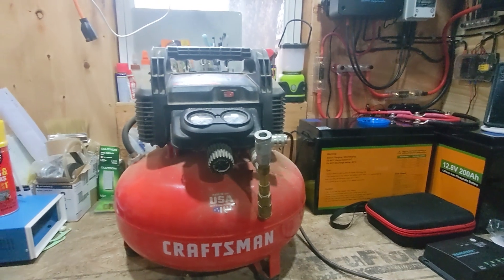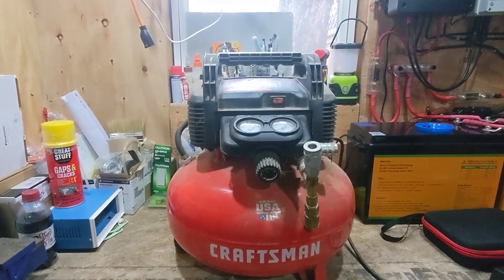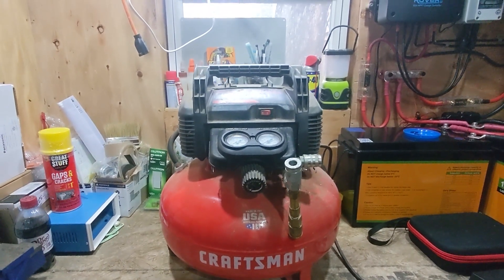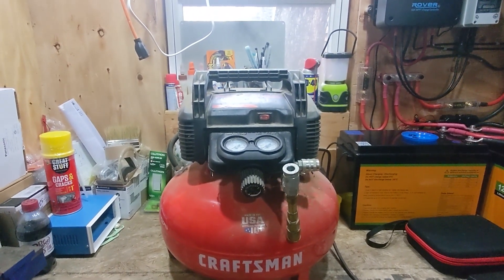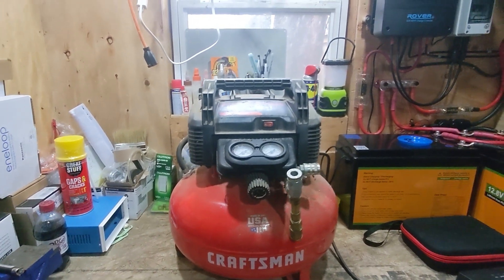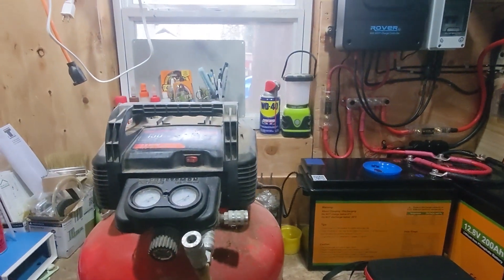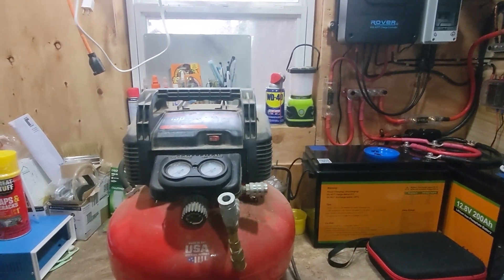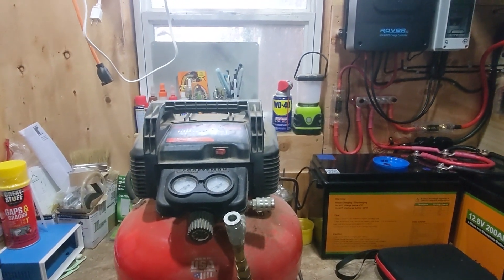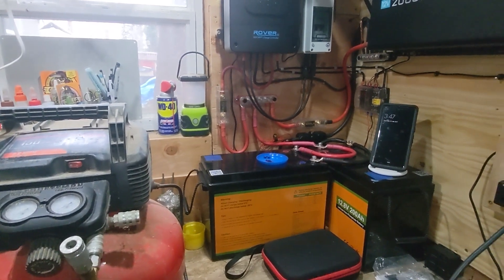This is the air compressor here — it's an old Craftsman that I bought a few years ago for about $100. They want almost $200 for them now, which is crazy. They're just a middle-of-the-line homeowner air compressor as far as I'm concerned, but it fits the bill for what I'm up to these days. It is a 10-amp, 120-volt unit, which means it's drawing about 1,200 watts continuous, plus whatever the startup draw is — which is where we get into trouble.